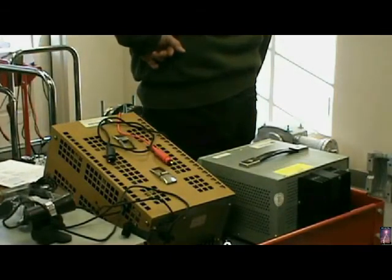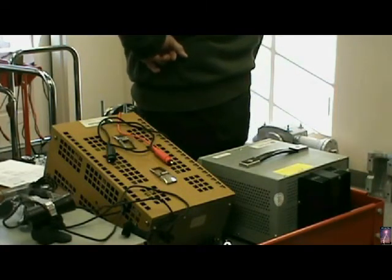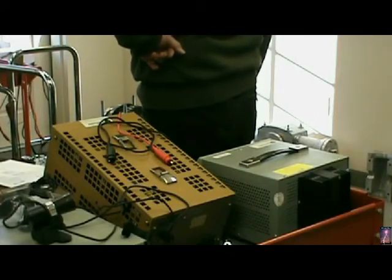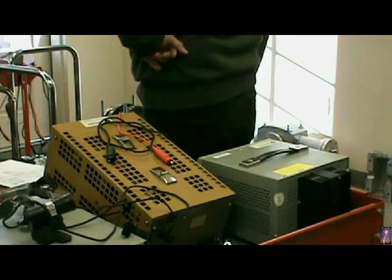Anyway, we have motor controllers, or cylinder controllers, ready to go. We've got a set for this one, a set for that one, and a set for that one over there. Everybody, we've got 3 complete sets, and we could build more. But I don't want to build any more right this second, because we're using 4 different MOSFETs, or FET switches, on them, and I want to run some tests to see which one of those works best.